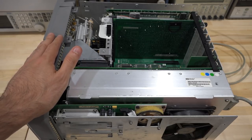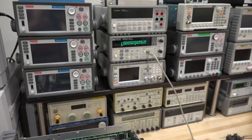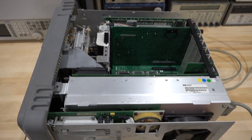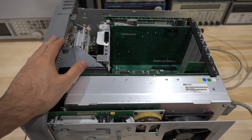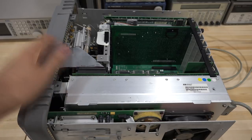The very first thing is to make sure the 10 MHz reference is working. I've taken the 10 MHz out and connected it to my frequency counter, which was calibrated with my Rubidium standard. You can see it's 10 MHz — off by less than 1 Hz. This unit actually does have a precision reference with an oven-controlled crystal somewhere in there. First step looks good, and now we have to take more things apart, go back to the block diagram, and do some more tests.